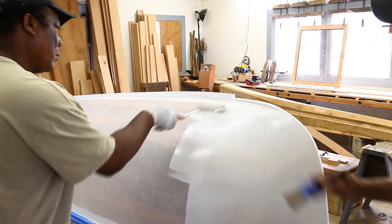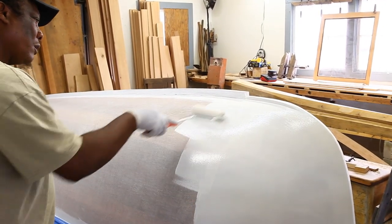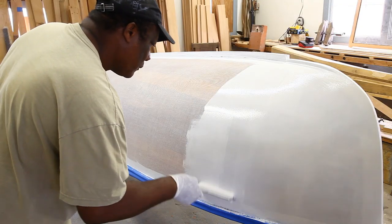We've started up forward rolling the paint on with these little foam rollers, and they really do a nice job. There's really no need to tip it like finished paint, and it dries quite quickly — it kind of draws down as it dries. It can be sprayed, rolled, or brushed. Here we're rolling it with foam rollers, and that works great on wood, fiberglass, and gel coat.